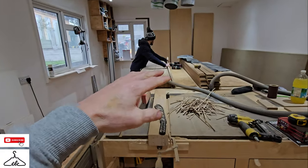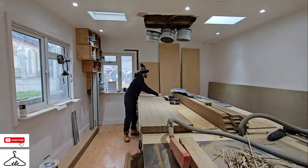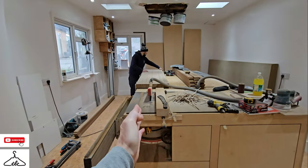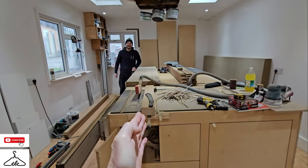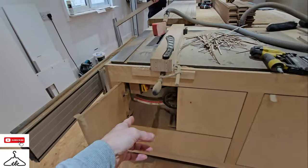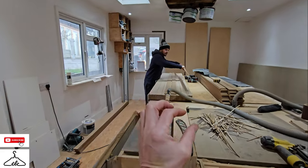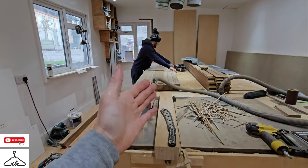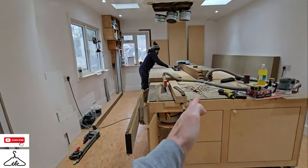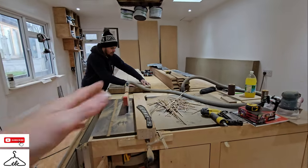So when it comes to cutting, what Sean did is he cut the board in half first. He set that first rip at 608mm on the table saw — because he's taken into account all the waste and done his calculations to get as many 64mm strips as possible out of a sheet. And out of 10 sheets, this is all the waste he had apart from dust. So we're really maximising the pieces we get out of boards — we're not left with a 20, 30, or 40mm strip we can't use. It's 64mm strips, 18 per sheet. First rip at 608mm giving you 2 halves, then set to 64mm and rip them all through — minimal waste.